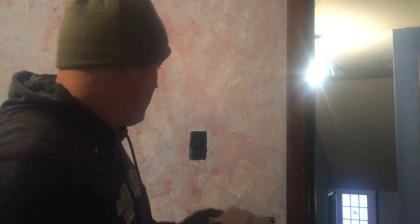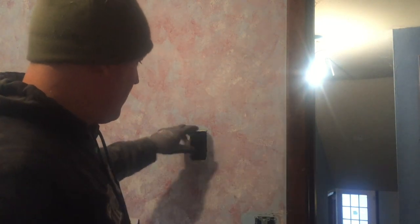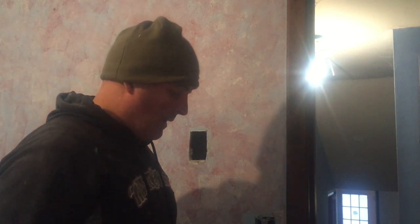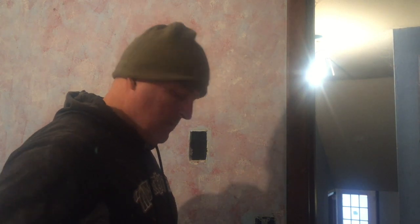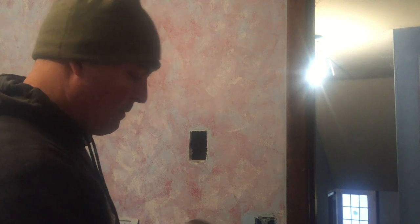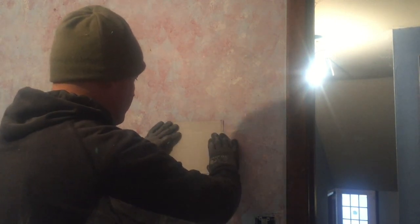And I mean, all I had was a drywall knife. It's the only tool you need. I've seen people use hole saws, and you need a smaller hole saw and a bigger hole saw, which works fine. But if you don't have hole saws and you want to do something really simple, just use a drywall knife or a Stanley knife, and take this patch here that you've made, and it goes in there like that,